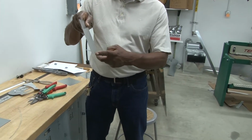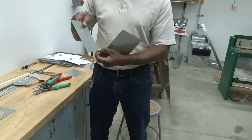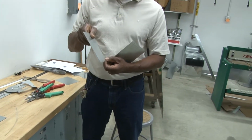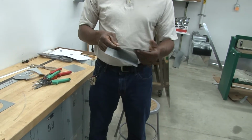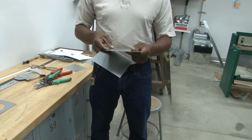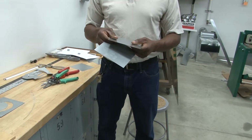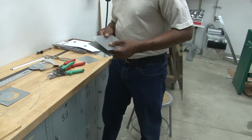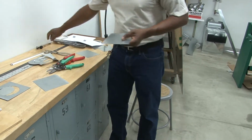And usually we have a fold of 90 degrees, folded over a 1/4 inch. So if you look at a Pittsburgh seam, one side of it will be a 1/4 inch folded over 90 degrees, and the Pittsburgh machine will have another amount of take-up on it that needs to be added to the duct. Most of the time, most Pittsburghs are going to be around 1 inch. Matter of fact, if someone has a scribe that we'll call the Christmas tree, I'll talk about that real quick.